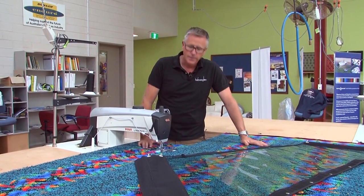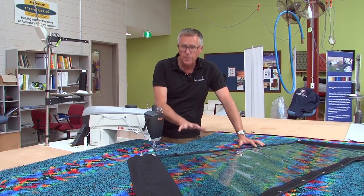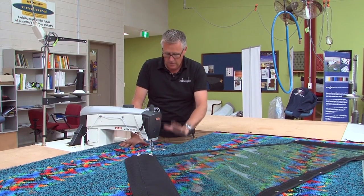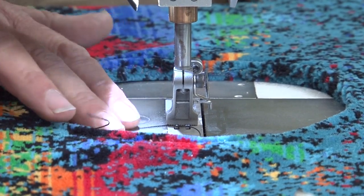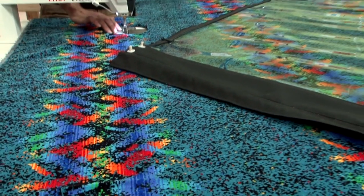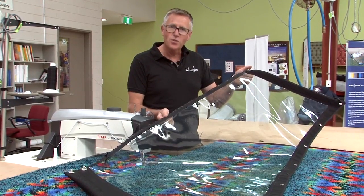Remember this — it is critical that the bench is lined. All plastics scratch, so be very diligent with the way that you manufacture your bench cover. Also keep in mind, the base plates on your sewing machines will need to be backed and polished. That is critical. You've got this curtain going through being stitched multiple times — you must give yourself the best opportunity to offer the greatest protection to the product.